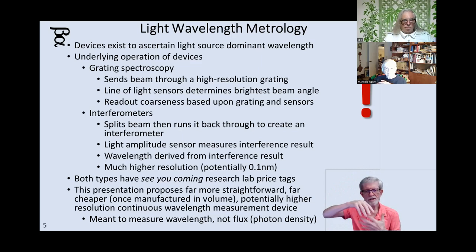Those sensors are integral — once you spread the light out, if you use individual sensors they're not continuous: there's sensor, then another sensor, then another sensor. The sensors are not measuring color; they're measuring brightness at the particular angle. So it will not only miss some colors, there'll be gaps. You can also put a color one-shot camera at the receiving end of that prism or grating and collect as many colors as you have pixels along the arc where the rainbow shows up, and as many colors as your one-shot camera can discern.